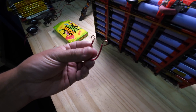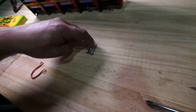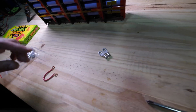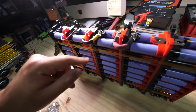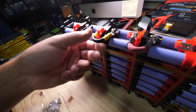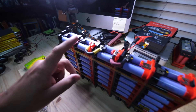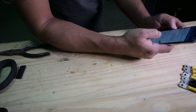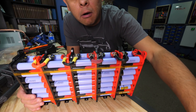That's the cheap way to do it — you make a bunch of these and then install them. The second least expensive option uses these connectors, but they're kind of expensive, probably a buck and a half each, so there's like three dollars right there. Then there's the cable itself — this one is silicone welding cable, RC high-temperature silicone. I love working with that because it's super flexible, so I'm going to use that. I just want to show you that there are different ways of doing this.